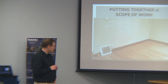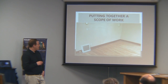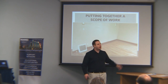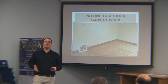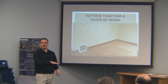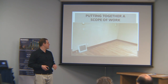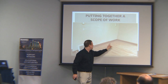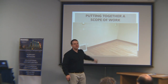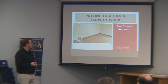Here's the living room. The floor needs to be sanded down. This is actually a little deceptive — this floor is already sanded, with no stain on it except along the corners. When finishing the floor, they sand it down, put a layer of stain, then a layer of polyurethane. If you buff off the polyurethane you can stain it again. They've already sanded off all of it except the edges. So we need to sand just the sides and then restain.